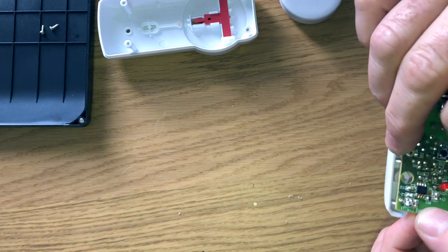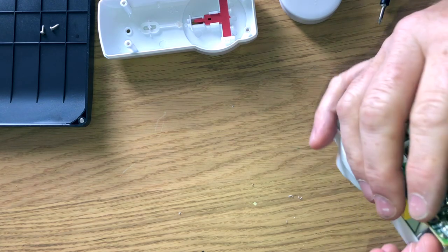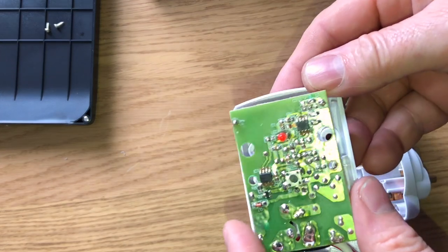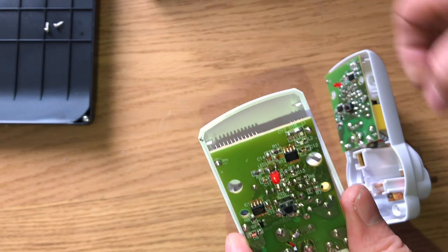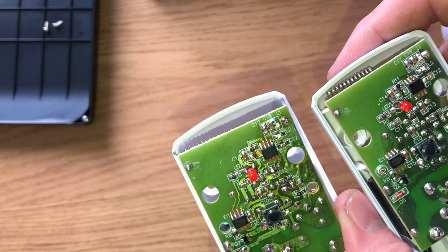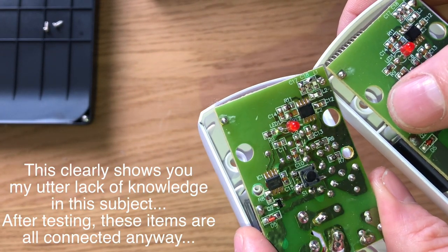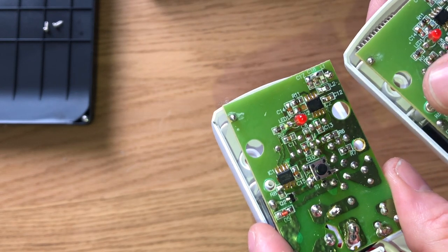So what I've done — this is the original one with the fault. The spring has loosened, and I've also noticed there's a blob of solder going across. If you look at a working one you'll see no blob of solder — all lovely and clean, and that's solid too. You don't need to be a rocket scientist to work out that if we've got that shorting that, and that loose, it clearly can't be good. I don't know what's happened to cause that, but we'll clear that up, resolder it, and see if we can get this thing back up and working.